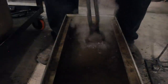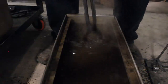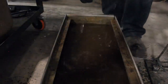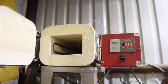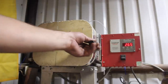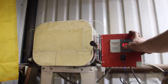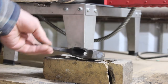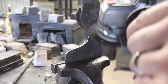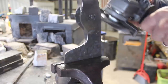After several cycles we can go ahead and quench it. You'll notice I'm agitating the axe head vigorously in the water — this is important, otherwise it will form a vapor jacket which will slow the cooling process and potentially give you a bad quench. Let's go ahead and temper this out a couple of times. It's the next day and now that the hatchet's all tempered and ready to go, we can clean up the surface with a wire brush — it gives a real nice finish, takes all the scale off and reveals that neat forged finish of the steel.